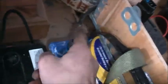I have three good batteries from my ZVS. I haven't got any more of these battery terminal clips, so I've actually used some copper pipe, flattened it out, and just clamped it on. Works quite well. That's the old Commodore one, just repurposed it. There we are, done. I'll stick them under that table. There's a little wire going to a bigger connector for this.